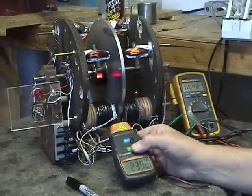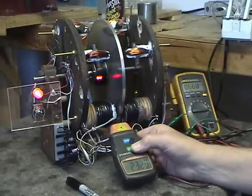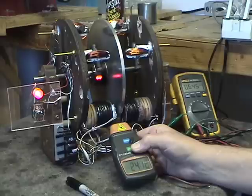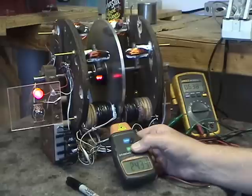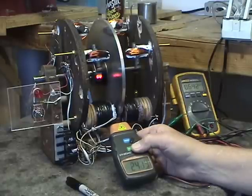When these coils start to pull power, they not only act as generators but also act as motor driver circuits. We'll turn the load on again — watch the RPMs immediately start going up and the current immediately starts going down. When we turn the load off, the RPMs go down and the current goes up.